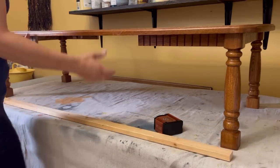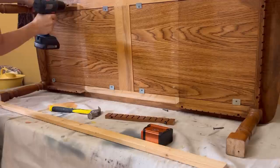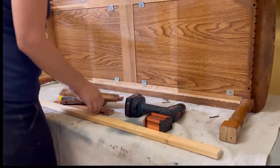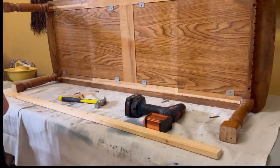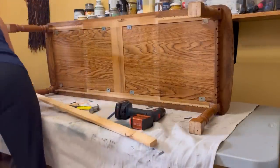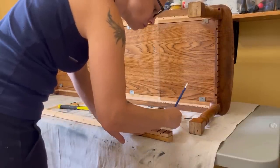In order to match the end skirting pieces, I was going to have to cut new pieces for the longer sides. I matched them up pretty well using some one-by-two pine pieces I had laying around. I took off the existing pieces to put in the longer piece, and then I'm going to mark where all the grooves are, because the end pieces have grooves all the way along. I'm going to use my miter saw to cut in all the grooves to match.